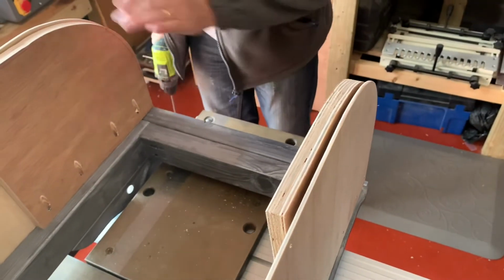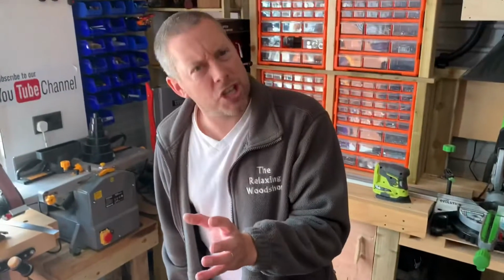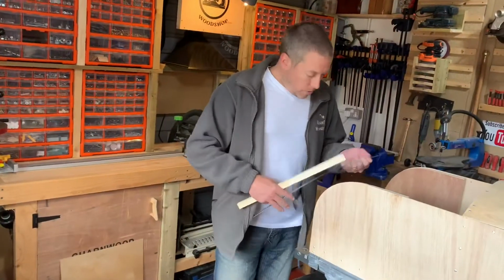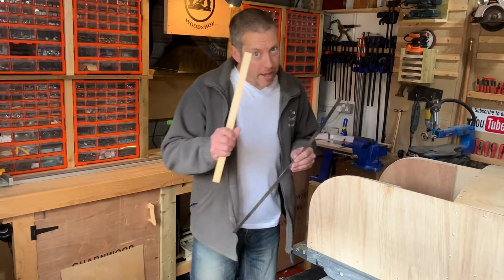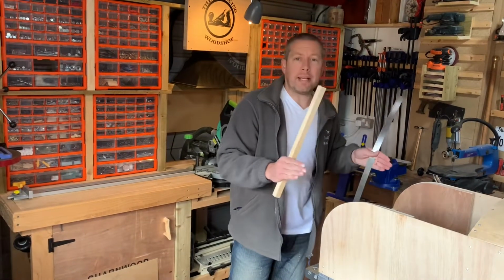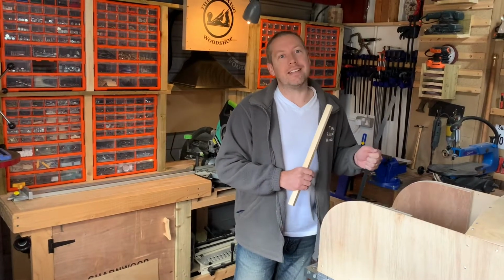So what we do now is get 2 support bars going across here to really give a lot of rigidity. Rigidity? One of them ones. I'll let you work one out. And then go nice and tight, and that allows us to give good support at the back. Okay, so now we have 39.5, measure twice, cut once. So we'll cut this down, then we'll put more pocket holes in each side of this, and then that should hopefully nestle in beautifully in between those 2 pieces of wood. Nestle in, that was a good one. That was a really good one.